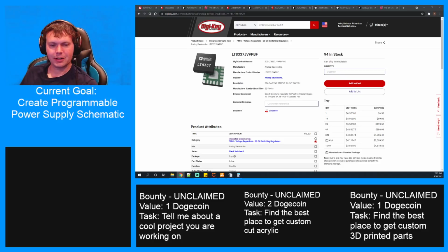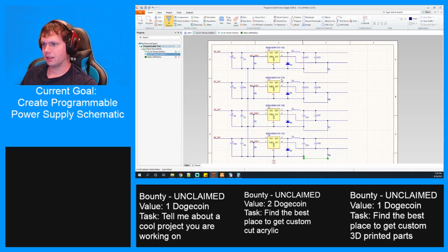I just want to see the price of this regulator. Oh, these are like $1 each. I might get them anyway then, because at least it gives us some breathing room and they can handle the input. In that case, if we just kept the same regulator, we'd probably have to adjust this resistor to be a lot bigger and then put the potentiometer up here. Okay.